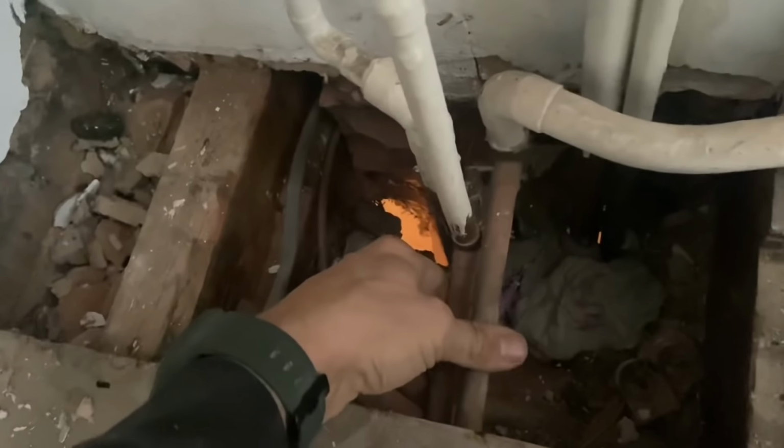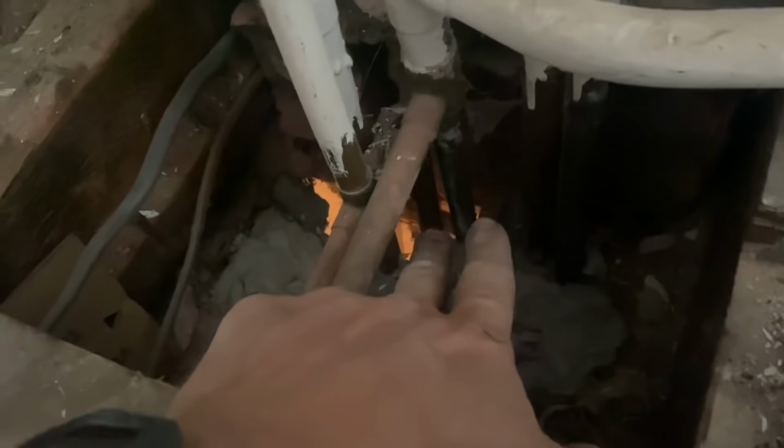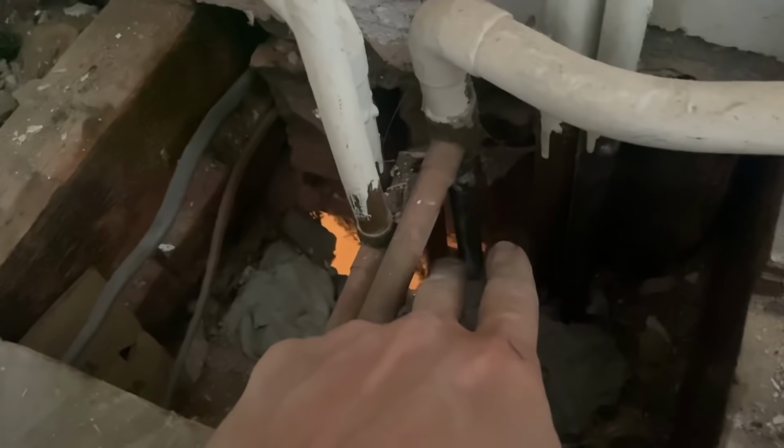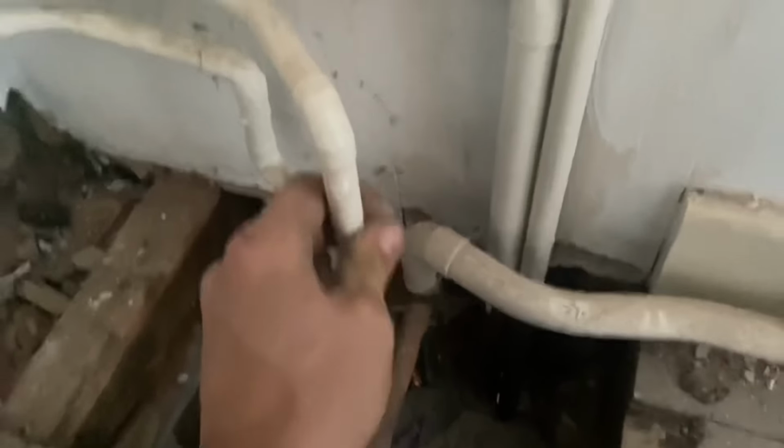T into these two. So these two are the upstairs heating circuit, they've got to stay. And they also go down to the new boiler. So basically what I'm saying is this T's going and this T's going and they need to be reconnected. So this pipe's gone and this pipe's gone.